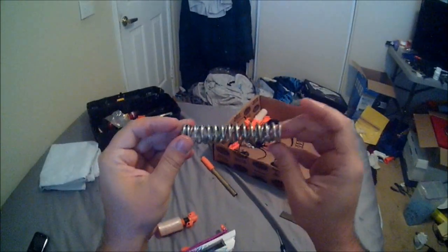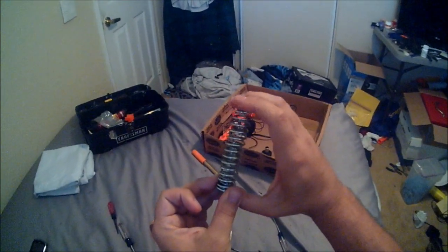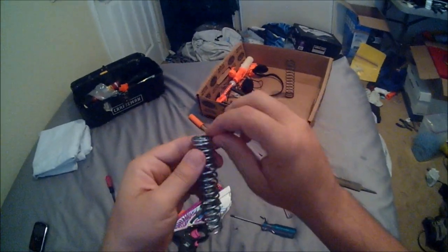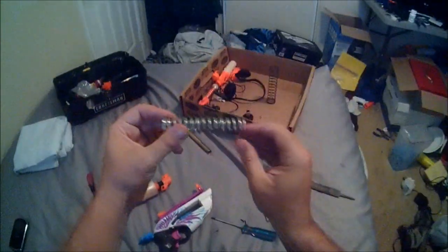It is 2 springs. It is a number 62 Hillman on the inside, which is around 18 kilograms, and you can notice that the outer spring, which is 11 kilograms, is a lot softer than the inner one. The inner one's a tough spring, and all the ends are ground flat right there. That's a Home Depot 7/8 spring right there. It's got a 3/4 pole cap, but look how I take the pole cap and twist that around the coil just perfectly. And then that one has to be held in, but the inner spring is just snapped in there.